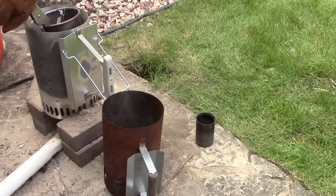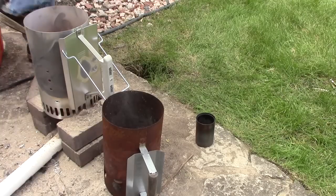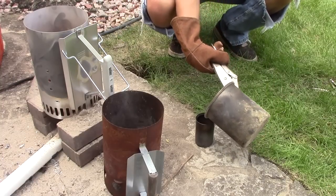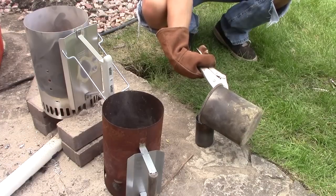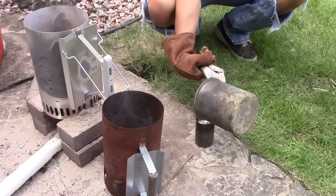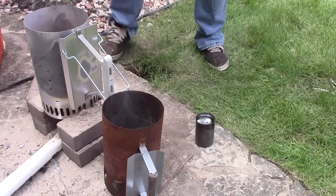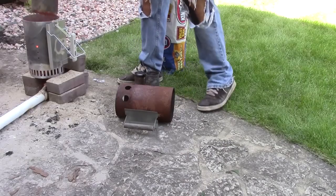So I got enough metal to where it will pour now, and I was so scared that I might get a burn through. Once I got it to a certain amount of metal, I just decided to pour it in a soup can, and you can see that soup can has been put in a fire. I was a little concerned that the coating on the inside, I saw some guys do that and they got some porosity, so I put that in the fire, let it burn all that stuff off, and then pour it.